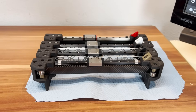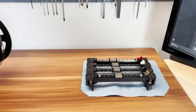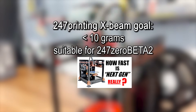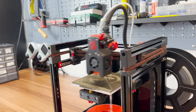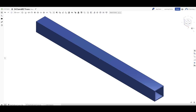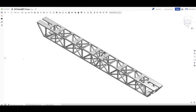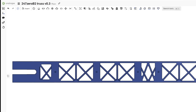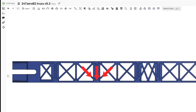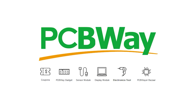Looking at all of these approaches, I asked myself: how extreme can we go in terms of weight? I set one simple goal — less than 10g and stiff enough for a lightweight Bowden config, with a bonus if it also works for the heavier Mini Afterburner. To achieve this, I started with a hollow 15x15mm aluminum profile with 1mm wall thickness and removed as much material as possible. The resulting forces are introduced on the mounting points of the linear rails, so I positioned the supporting struts to create a closed loop of force flow starting and ending on those mounting points. Thanks to PCBWay, this design was made reality.